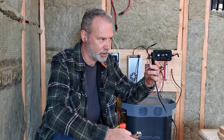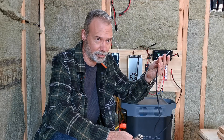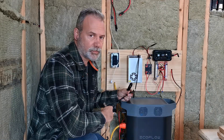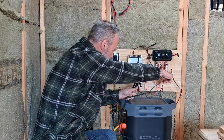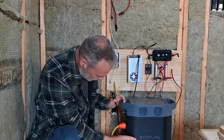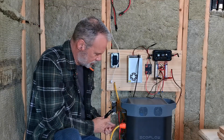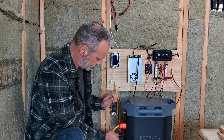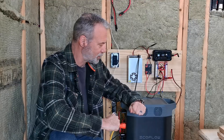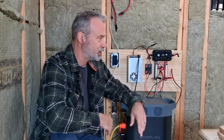What I've been trying to do - and it seems to be quite effective - is I have a lighter plug, and it came with these connectors and alligator clips. By hooking up these clips to my distribution block, red on red, black on black - pretty simple. Turn on my 12-volt, just the 12-volt so the AC is not on. Turn on my 12-volt system, and I've got my 12-volt system without running the overhead of both the power supply and the inverter. So it saves a lot of watt-hours by doing it that way if all I need is the 12-volt.